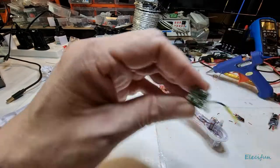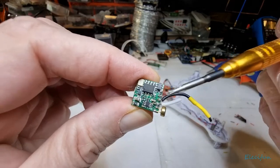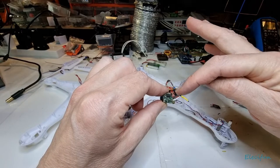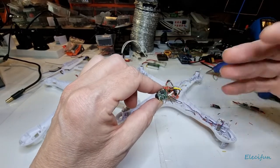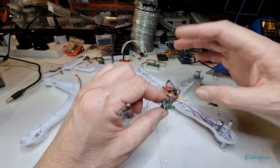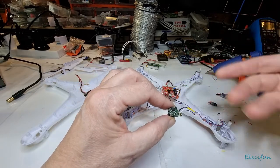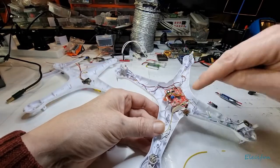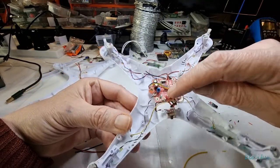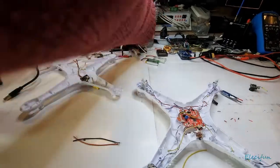We need to get some wire onto the battery connection points. There's a little tiny VCC pad — that's where the power cable goes. I'm going to put some silicone wire on it because I really don't like hard plastic wires. I prefer silicone wire because it's softer, it can take higher temperatures, and it's easier to manipulate and bend. So we've got B-negative and B-positive — that's battery positive and negative — and that's where we're going to be hooking up.